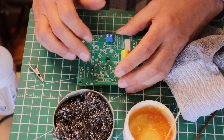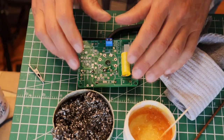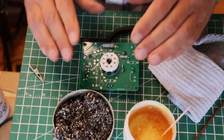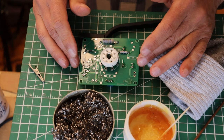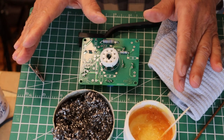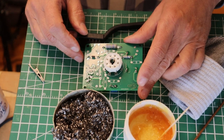Dip the brush into a little bit of acetone, scrub away, come back and wipe off, and keep doing it until you get all that sticky stuff off. Then come back with 99% isopropyl alcohol on a clean rag for more cleanup - the alcohol will help clean off the last of the gunk. Do this outside and dispose of your rags safely; they're a fire hazard. Drape them on a sawhorse outside in open air - never pile up rags, they can self-combust.